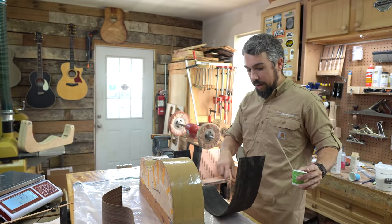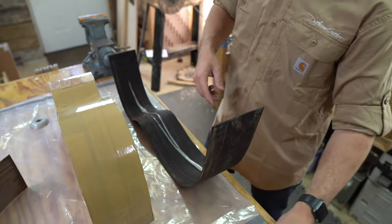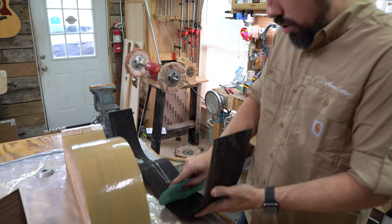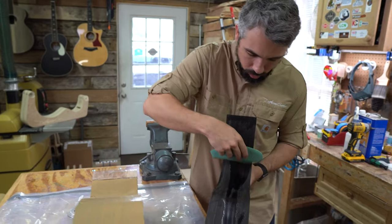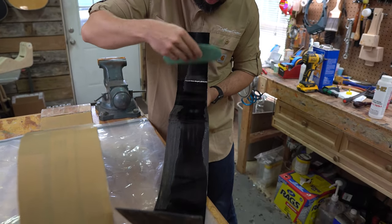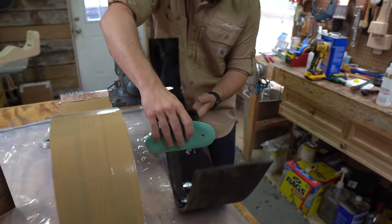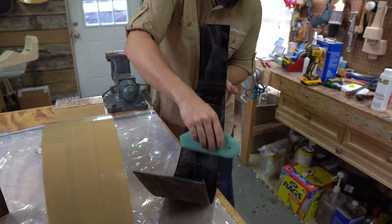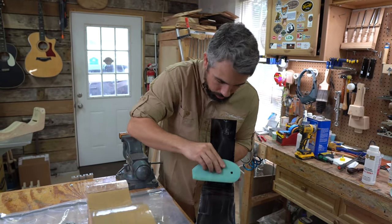I do my outside piece first. I come in and slather on some epoxy — you want to be careful here because this can turn into a really big mess. I'm using the little silicone spreaders I mentioned in my how-to-prep-a-guitar-for-finish video. These are actually meant for scraping the bowls of KitchenAid mixers, but they're silicone and work great for guitar building — way better than the Bondo brand ones. I'm just trying to float a micro-layer on there. I'm not trying to scrape the epoxy off, just get a thin coat to the edges.